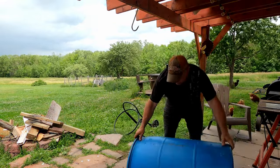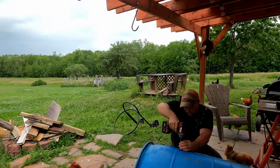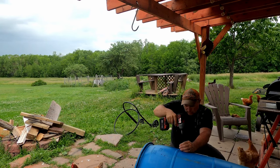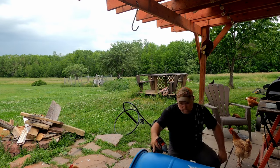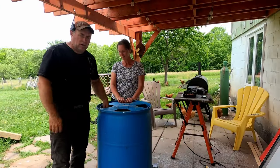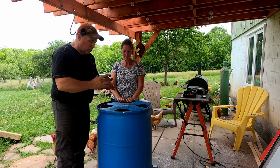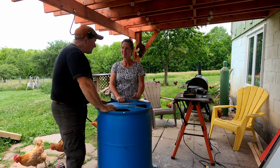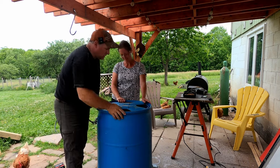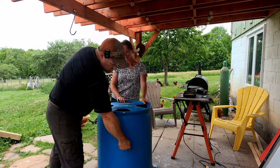There's a little channel right here and I want the nylon plate to set right in that. I'm thinking if I just put a couple screws here it should make it so I can lay that in there level. Since you can't hold that piece of nylon in place with your hands around the edges, and I didn't put a handle in the center because that's where my block is sitting, I just took four screws and put them through here - that allowed the nylon piece to settle right down on top of those.